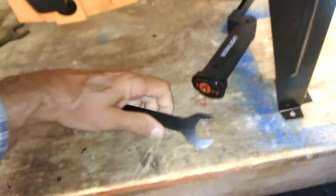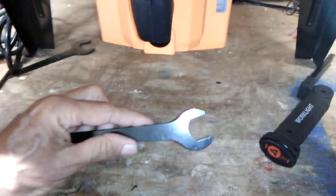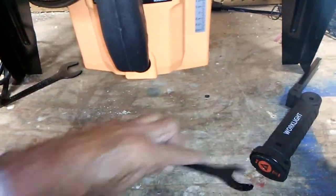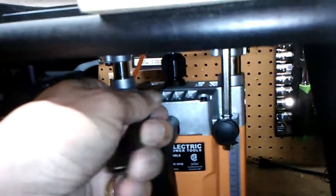It comes with these little wrenches to change bits — throw those wrenches away, they're no good. Get yourself an actual 21mm metric wrench and a 24mm metric wrench, and you will be a lot less frustrated trying to set this thing up.